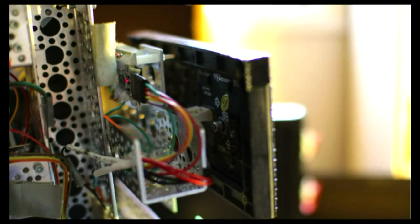The front of the robot uses small U-channel sections with microcontrollers running everything. I discovered a source for 17-segment displays instead of 7-segment, so you can display alphanumeric characters. I ran it on a breadboard, saw there were far too many wires, so I designed a PCB and had it printed in China. The high and low side driver I proto-boarded to cut down on connections — using two transistors, four resistors for a high-side switch, a GPIO extender, and the ULN2803 current sink with resistors in line.